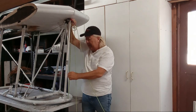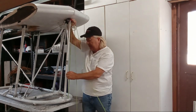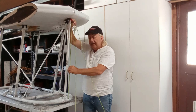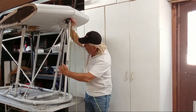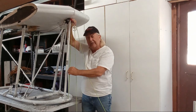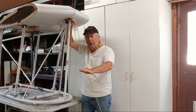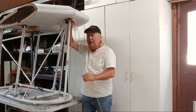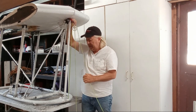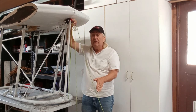When they bungee launch, car tow, or aero tow, they tow from a single point right about here, and I'll have a hook in there. We'll try to find the spot that's correct — that has no nose-up or nose-down pitching moment — somewhere that passes through the overall CG of the aircraft with me in it. Next time we go out we're just going to tow from that single point, and hopefully we'll avoid the pitching moment, so I won't be using half of my available control just to keep the thing level on tow.